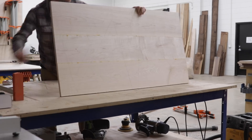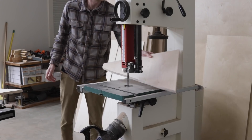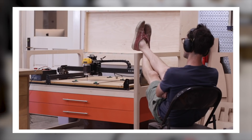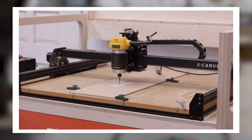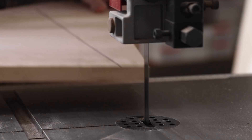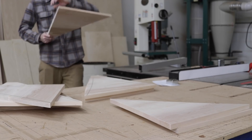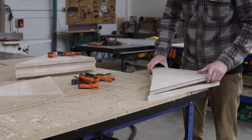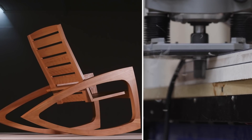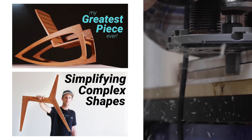Once these were glued up, I could break down each larger panel into rough shapes, then trace my template onto each one and start the trimming process. You're probably wondering why I didn't make MDF templates for this piece. Most of the time when making a piece, I'll make a template using our CNC router, and most of the time the parts I'm making with these templates require a lot of dimensional accuracy. The reason I opted not to make MDF templates here is because the parts don't require a ton of accuracy — they just need to be replicated multiple times. It didn't matter if an angle was slightly off or a dimension was a little long or short, as long as I liked the way the first panel looked. A piece like the rocking chair I designed last year requires very accurate parts to be replicated, so making MDF templates is definitely the way to go for something like that. I'll link to that video as well as another one about making and using templates in the description.